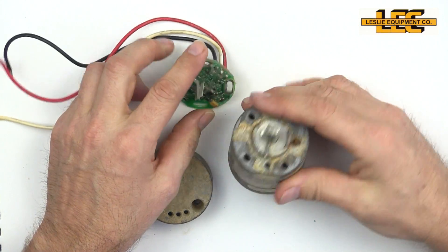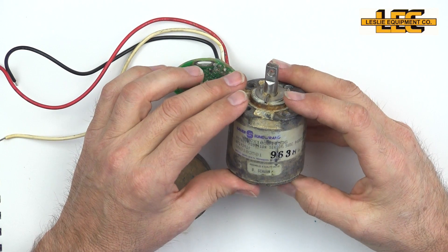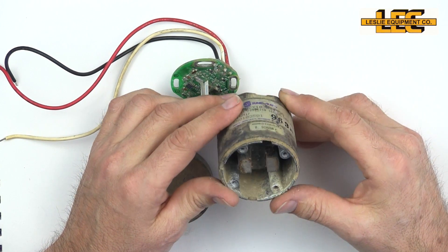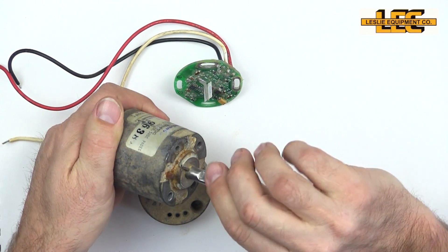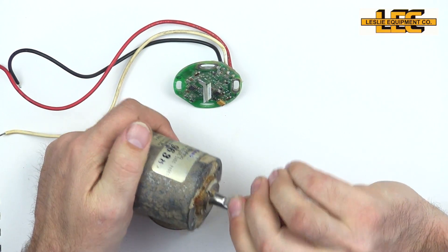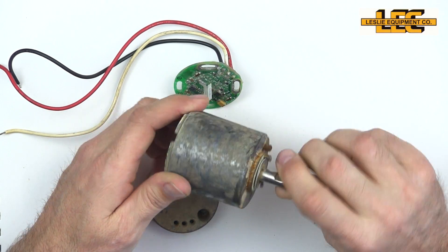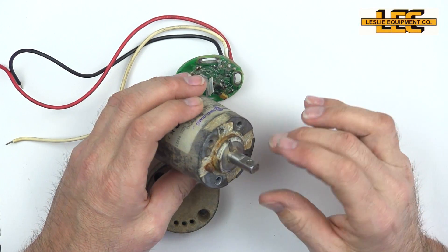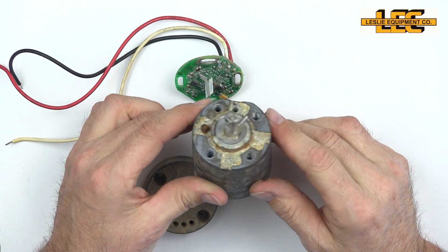This is the Sauer Sunstrand Rotary Position Sensor 5V DC 90 degrees, and these are used on a number of John Deere and associated machines. It's a position sensor because it rotates, giving you the position of a boom, a lever, a conveyor, a door, or anything that moves on a hinge or potentially rotates can be measured by this device.